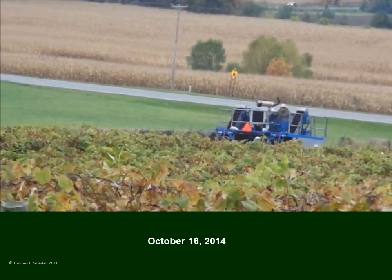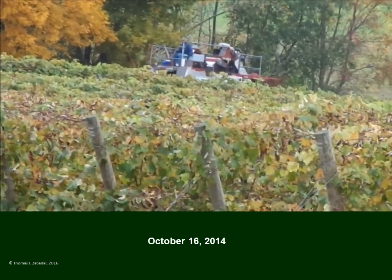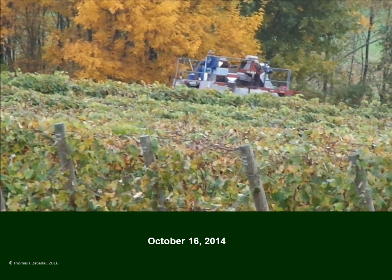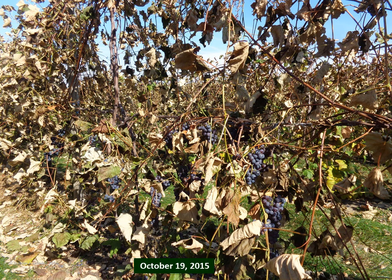This is file footage from 2014 showing that one of the National Grape Co-op members, Mr. John Hinkelman, was gracious enough to help us with the mechanical harvest of this vineyard. His two BEI machines do get over that seven-foot-tall trellis. In 2014 we were able to pick all the crop, but in 2015 that harvesting unit was unable to fully pick the Concord grapes on the lower cordon. So we're going back to the drawing board to decide what adjustments need to be made to the beaters on the harvester — or perhaps a different harvester — to make the system fully functional.